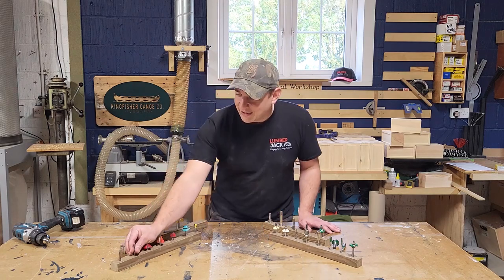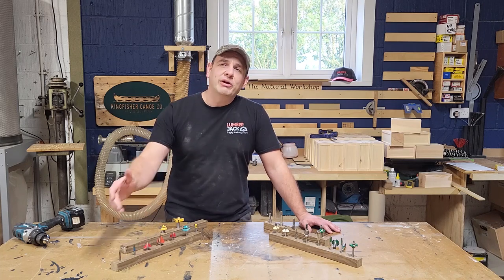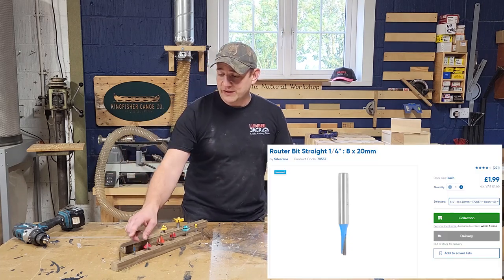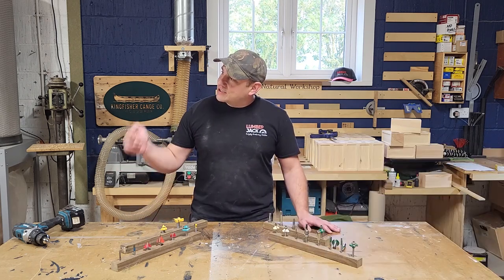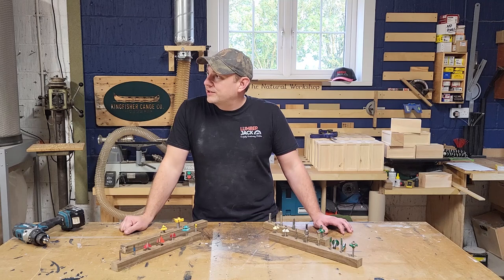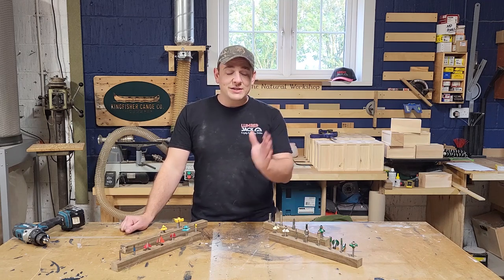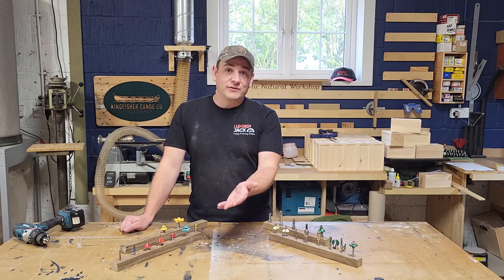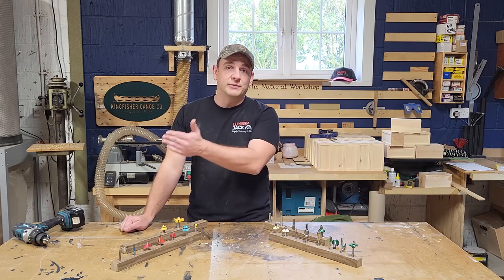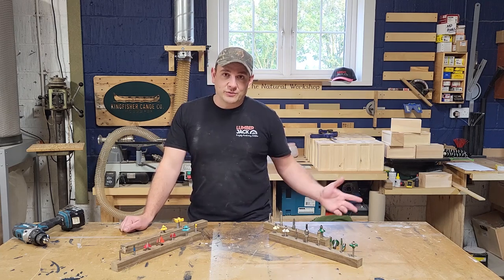This little bit over here is a Silverline bit — a branded bit, but very cheap. I think they're £2 each from Tool Station. That one in particular got changed out today. It's probably done getting on for 750 metres of work. So when you think 'that's £2, it's rubbish' — well, it lasted me 750 metres. I've taken it out because we're in the middle of a job, I'm going to sharpen it and put it back into rotation like all the other bits.